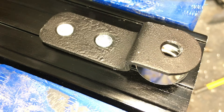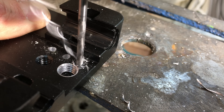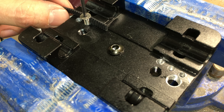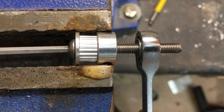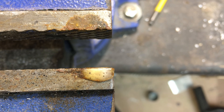Before I could add the pulley, I needed to modify the carriage a little bit. My goal was to attach both ends of the timing belt by wedging it down with a countersunk screw. I did not know the correct distance, so I drilled a few holes for trial and error — this worked surprisingly well. Now it was time to add the pulley. It is very important that you use lock nuts; anything else will just be really frustrating in the long run when it comes loose.